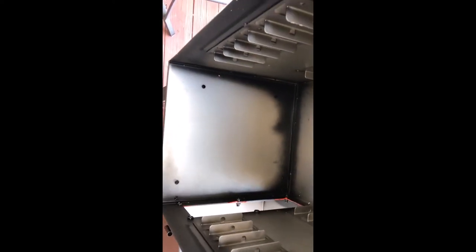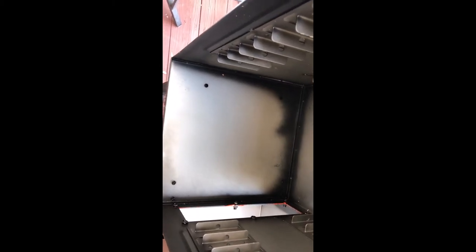I've got it lined up for the most part. There are two holes there that I need to seal and make sure are lined up correctly, and two holes on the other side. Here's where I screwed up — I needed to put the sealant around the holes, metal to metal, not on the inside. So I'm going to have to take this off, lay it on my table, run the sealant, and then try to put this back on top. I recommend having somebody else help you with this.